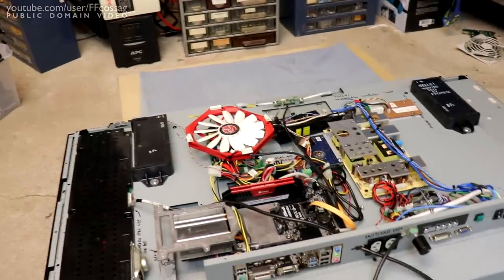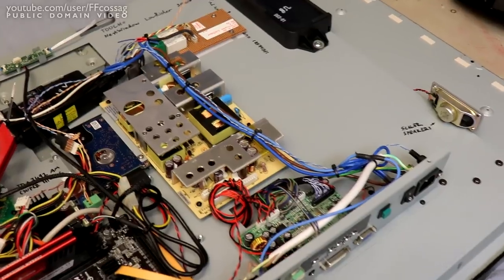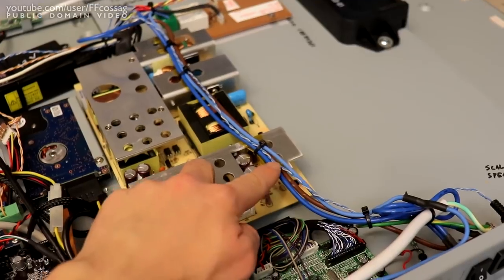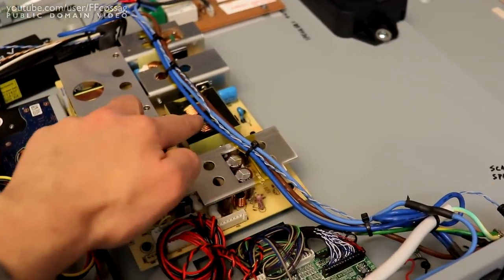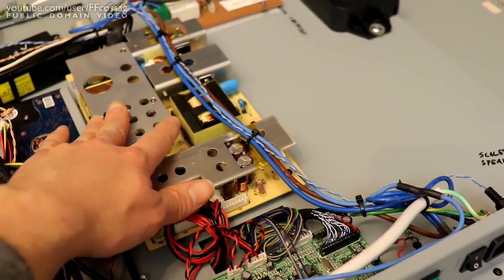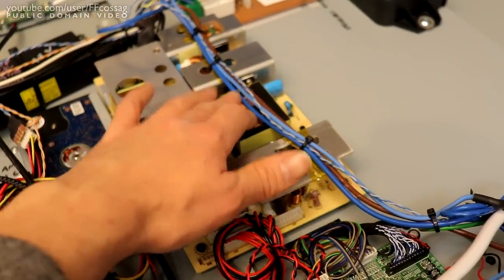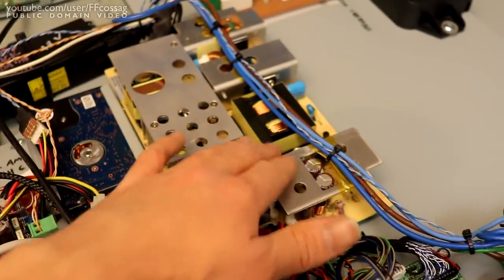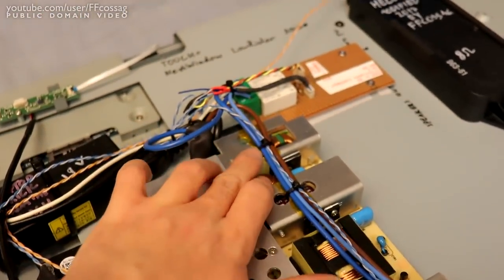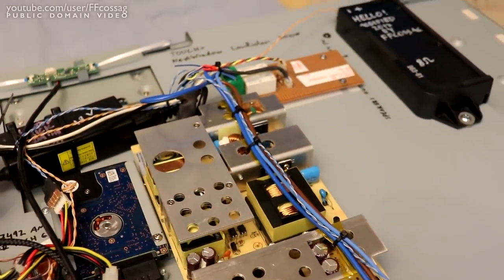Most of the looming work is done to prevent the unprotected CAT5 internal wires from touching the underside of power supply boards where there might be 230 volts — stuff like this isn't dangerously exposed because it's all lacquered wire in the transformer, and I've taken effort to isolate underneath the heatsinks. These are not live heatsinks but just to be on the safe side.